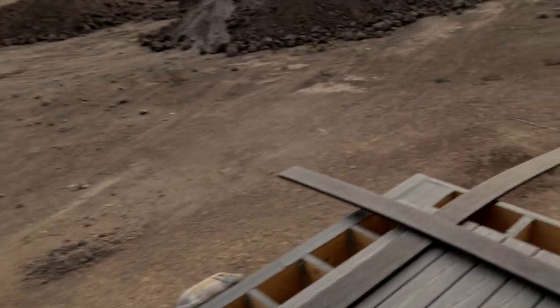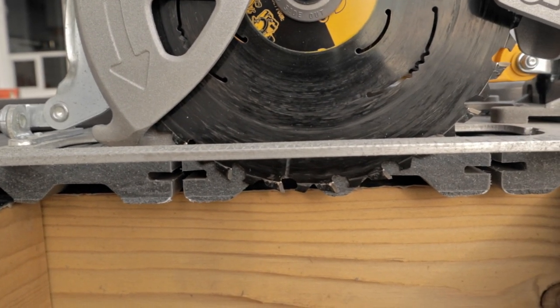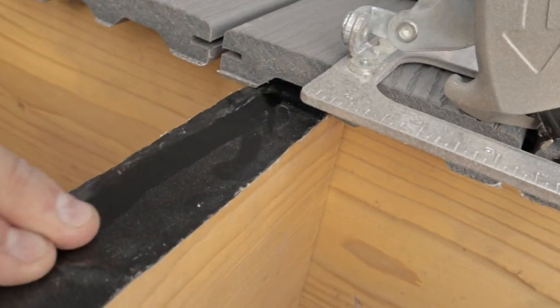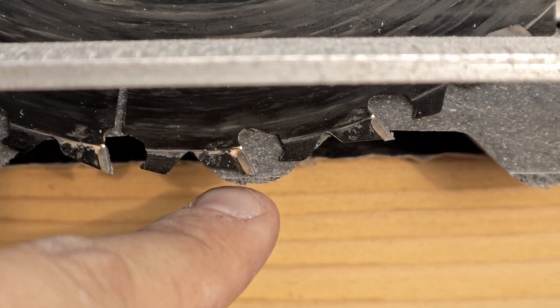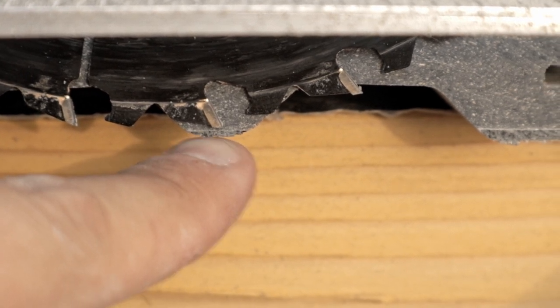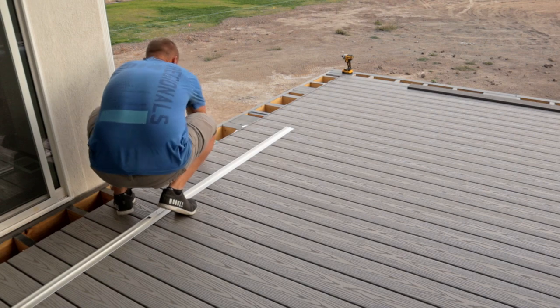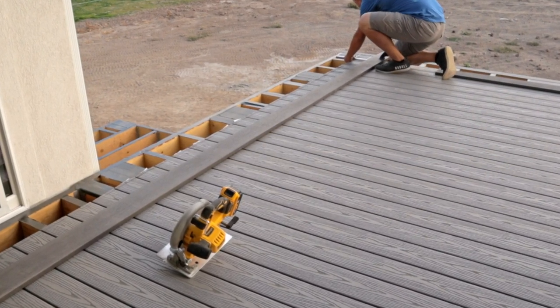Now that I've got the decking laid down for the most part, it's time to put our picture frame on. Don't worry about measuring each board specifically before screwing it in — we're going to go through and cut a straight line. When getting ready to cut, make sure your blade is just slightly above the bottom of that board. You don't want to cut the butyl tape you put down because that defeats the purpose. I set the blade so there's about a sixteenth of an inch of space between the blade and the tape. I measured across the deck for uniform measurements and marked a chalk line, giving me a perfect square to border with the other colored boards. I then laid one of the boards along the line to use as a fence for my circular saw and clamped it down to stop it from moving.